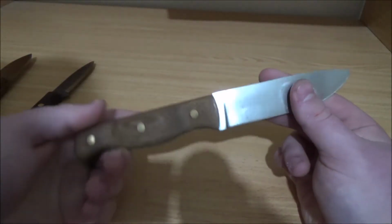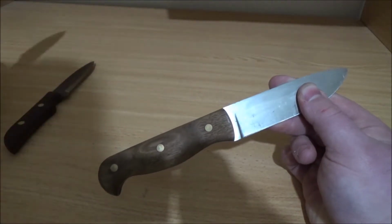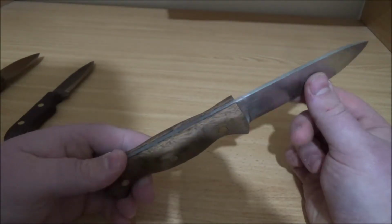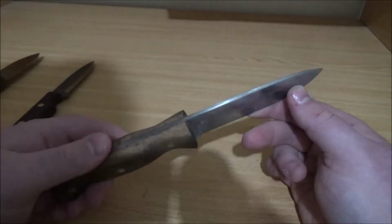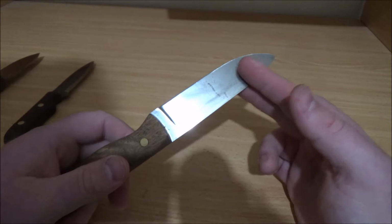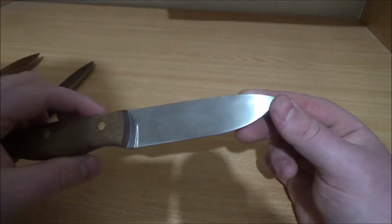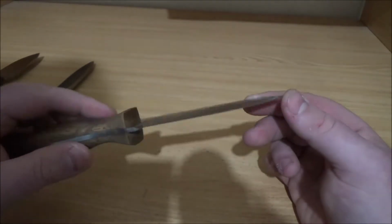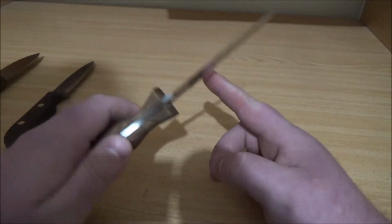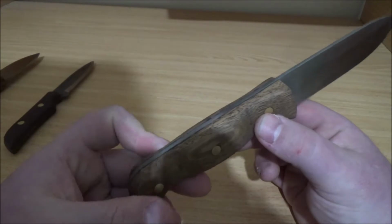My second knife with bar stock, and both of these were 1084 by the way. This one I was going for a sort of bushcraft type design. I was trying for a saber grind, but I couldn't keep it clean when I went for the hand sanding. I sanded it a bit higher, to 600 or 800 grit, and it came out quite nice. Strikes a ferro rod really well. They all do, except for the mild steel one.